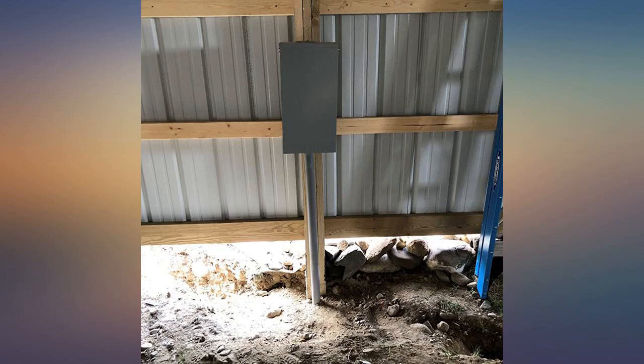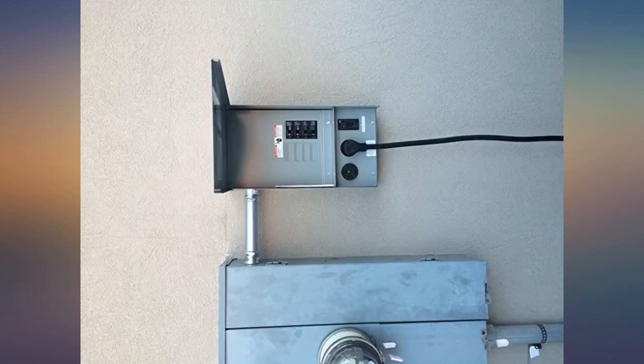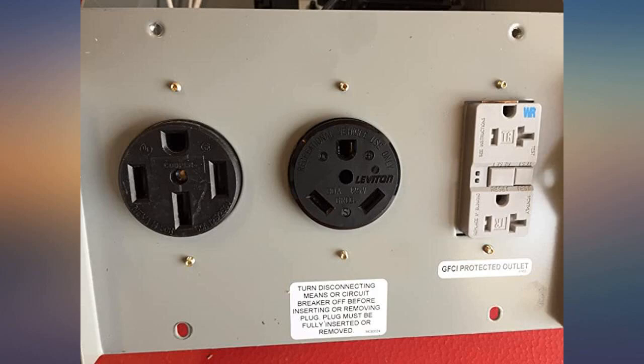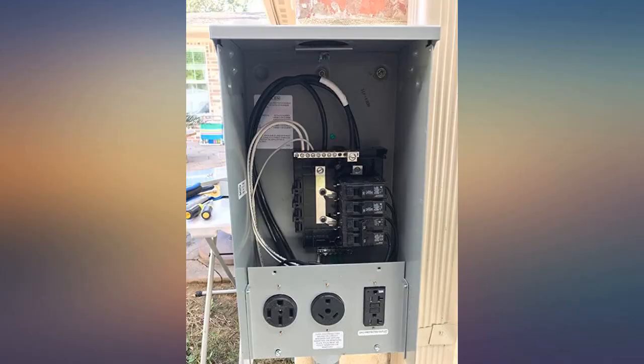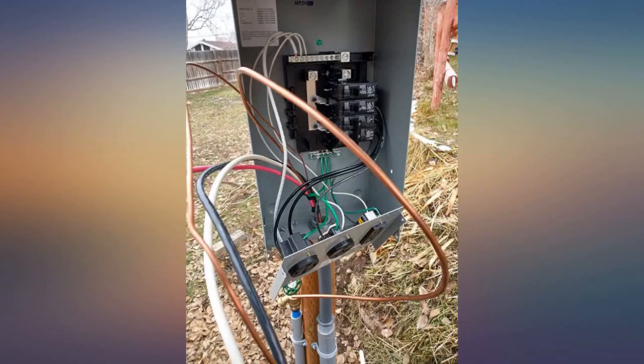One of the main reasons I really like this box is that it leaves a few extra open slots on the left side of the bus bars to add additional breakers. This is a really nice option and provides some flexibility. I found that I needed some extra space in the ground bar when I did this, because the ground bar is simply not large enough for the additional grounds.